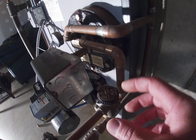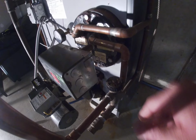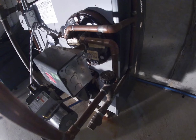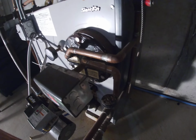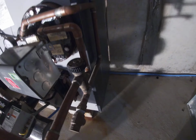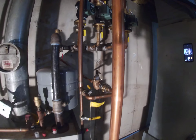to this device. This water comes out at random temperatures, so it has to be regulated. This is a... I'm having a blank here. Mixing valve. So this mixes hot and cold water. You have the hot water coming in here, we have cold water coming in here, and then we can adjust the temperature to our state code, our state regulation, which is 120 to 130 degrees at your kitchen sink. Then it comes out mixed at the proper temperature, distributed to the rest of your house.